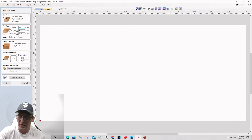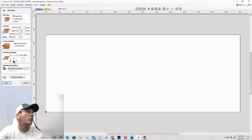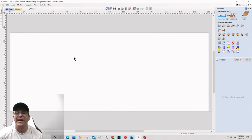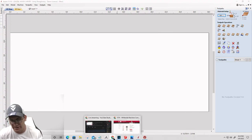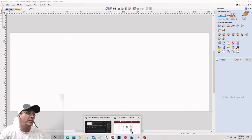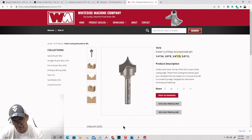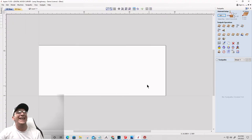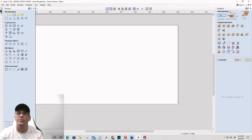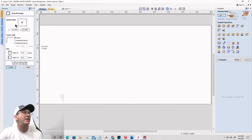Let's go back to Vectric Aspire. Our panel boards were 28 inches by 11 and a quarter by three-quarters - click OK. First thing I have to do is add that router bit to my tool database. I'll actually write that down - I need to order Whiteside 1574 off Amazon. That's my three-eighths radius. I've got the eighth-inch but not the three-eighths. To add it to the database, it's a form tool - we have to draw the right half of that bit.